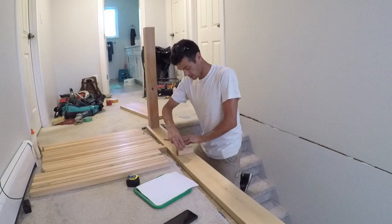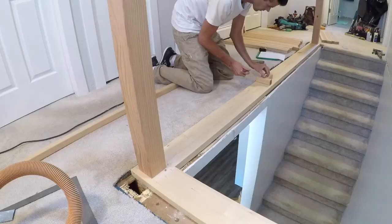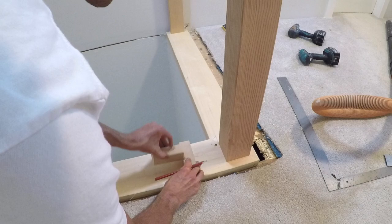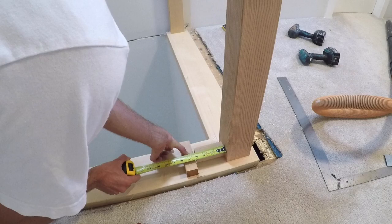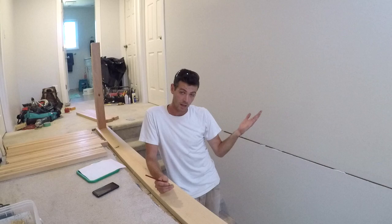There is also a possibility of error just doing this — I could be increasing it by like a thirty-second of an inch every pencil line. Also, the way I'm assembling this I actually need the lines here, so it's not going to be total wasted effort. It came out a quarter inch off — but it's close enough to four inches that we could fudge the last ones. I actually consider that pretty good. I can go with this layout and start to fudge the last four or five spindles if it looks like it's not going to make sense — not bad in my opinion.